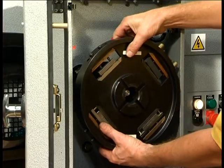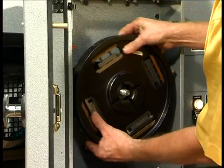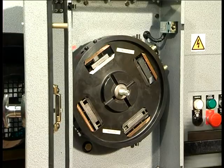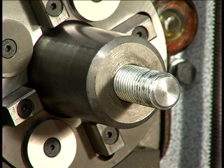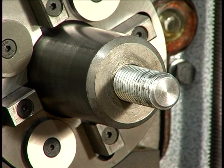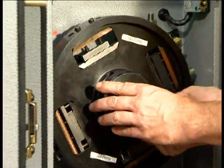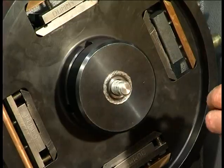The fixture is now loaded into the machine with the two cam stops positioned towards the top right hand corner. Do not worry about this exact position, as the keyways in the fixture and the drive keys on the drive spindle will finally position the rotating fixture. The fixture is now secured on the drive spindle with a clamping collar and nut.